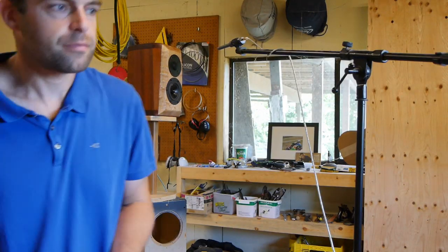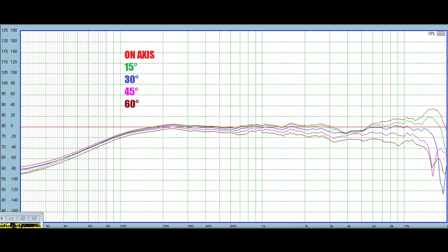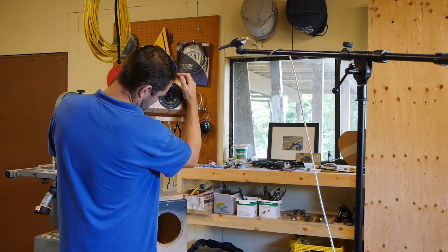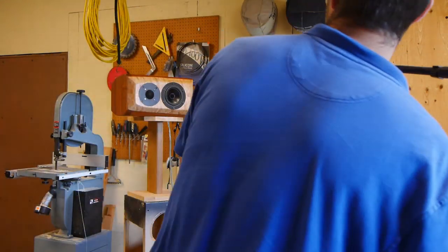Next up is measuring the off-axis response, and I'm really happy with this result. There's a little bit of diffraction around 4000 Hz due to baffle diffraction, but this is nearly textbook — I really can't complain. When I'm looking at the off-axis response I also try to approximate the power response. Basically you average the off-axis response, and you typically don't want flat — you want a kind of slope down towards the high frequencies. This doesn't slope as much as most people would probably want, but I'm okay with that for a surround speaker. I'm showing a bit of a power response dip in the diffraction zone, but that might actually be flatter in real life.